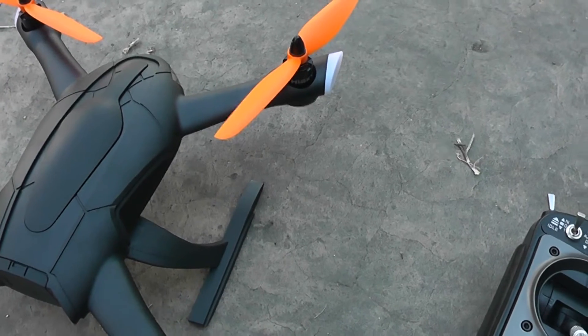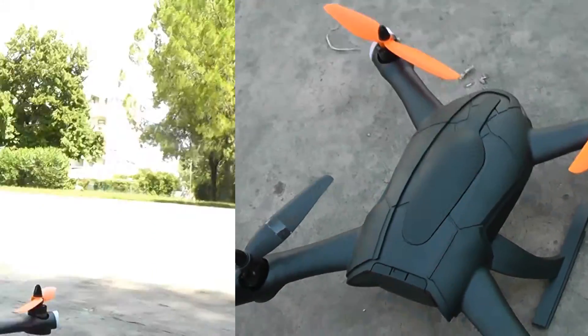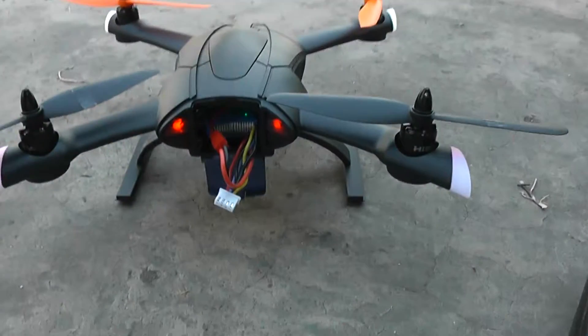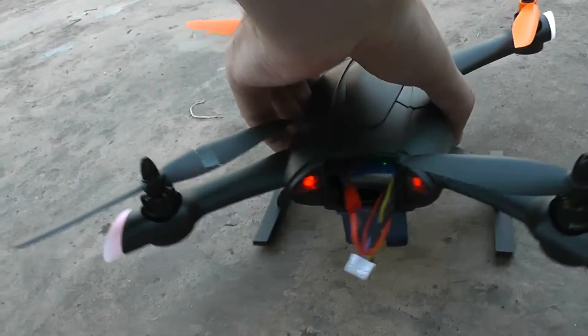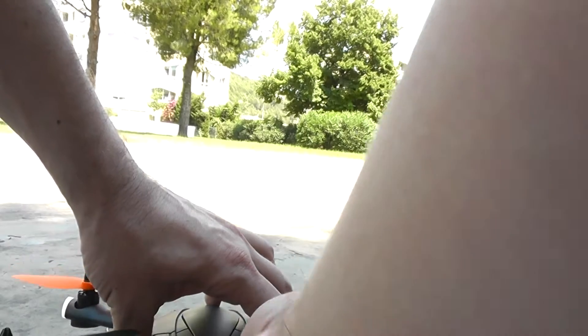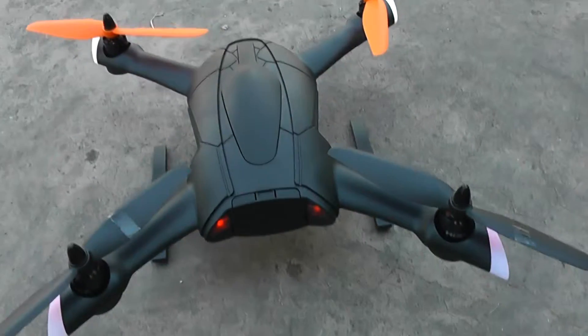It's a little bit windy today. I will try to make some first tests. I will turn on the batteries — you will hear the nice startup music of the iSky. I'll wait a bit; there are probably some gyroscope calibration steps. You have some red LEDs on front — two white on front and two red on rear. I found that the gauge of the power lead cable is a little bit thin to handle a 3S battery. Maybe you could have a problem with this choice of gauge.